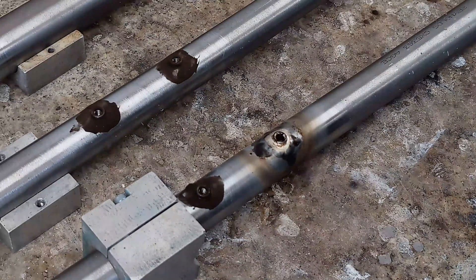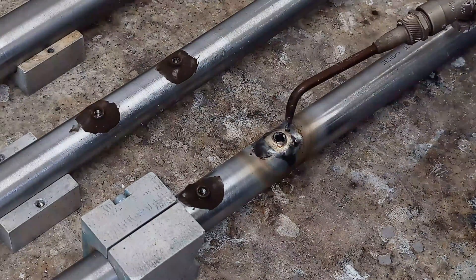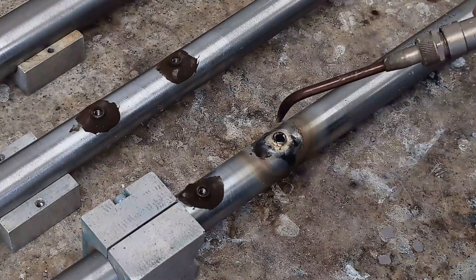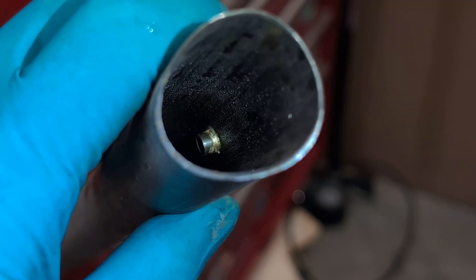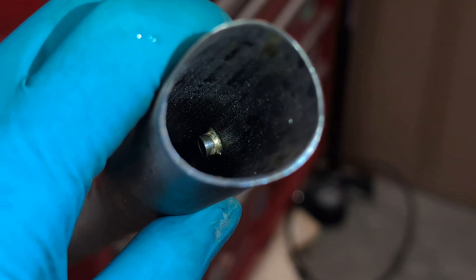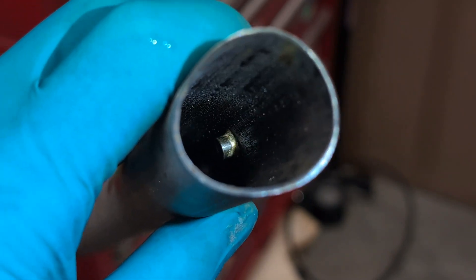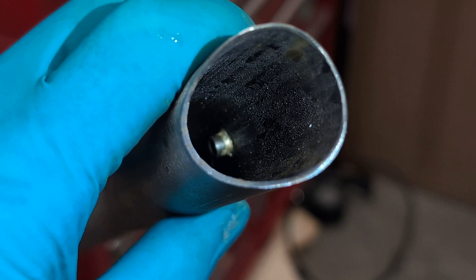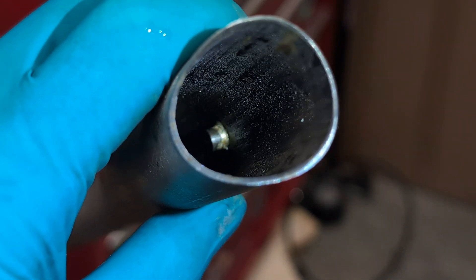You can watch the silver get pulled into the joint itself, and then that's one bottle boss down. You can tell it's hot enough because the silver really starts to blend in through the tube — there are no ridges, it's just a part of the material now. After you've soaked the flux off, you can shine a flashlight into the tube and you should be able to see a tiny little silver fillet around the inside of the brazed area inside the tube. That's how you can tell you've gotten proper pull-through on the silver.